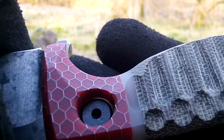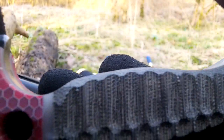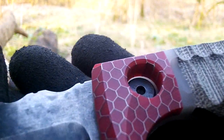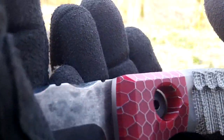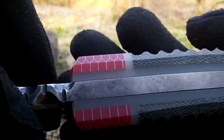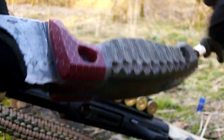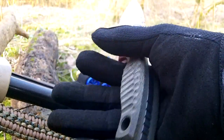The scales are CTEK bolsters with a glow-in-the-dark spacer and a pattern I don't really have a name for. The CTEK has a matte finish — it was bead blasted after being sanded and polished. I think that's actually the nicest finish you could ask for on CTEK; it looks way better than being polished. There's also micarta and glow-in-the-dark liners. It's quite chunky — I was going to contour it a bit more, but in a gloved hand it feels nice and positive.